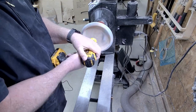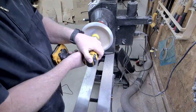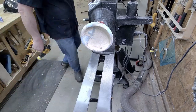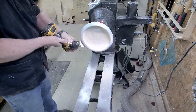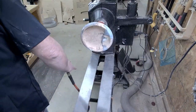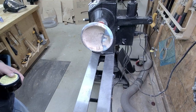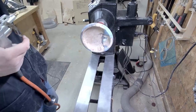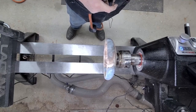After sanding, I went all the way up to 320 grit, and I've used the sanding paste, really leaving the epoxy and the maple burl to a fairly rough surface comparatively to being polished, and I'm going to be using a tabletop epoxy finish, so it's got to have some sort of surface to adhere to.